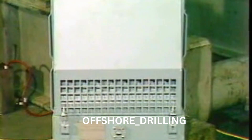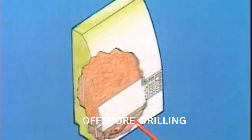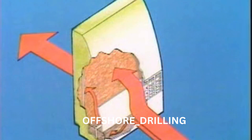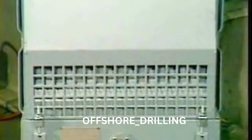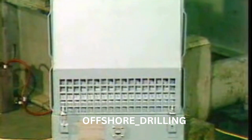Blower engines use panel-type oil bath air filters. Air comes in through the front cover of the filter and is deflected two different directions. Some air goes down into the filter oil supply, picks up oil, and is then routed upward by a baffle plate — the oil-laden air goes through the filter medium and leaves the oil on the filter before going into the blower. The rest of the air goes through this oil-wetted medium and deposits dirt particles on the filter before entering the blower. The dirt gets trapped and the constant flow of oil droplets drips down through the medium, providing a self-cleaning action. There's a sight glass on the lower front portion of the filter. The level is checked after the engine has been shut down for about a half hour to let the oil on the medium drain to the filter sump. At 1,400 hours, drain this oil — remove the plug at the bottom of the oil sump, allow all the oil and sludge to drain thoroughly, then replace the plug and refill with the recommended lube oil. The level should be at the center of the sight glass.